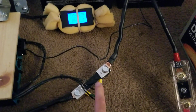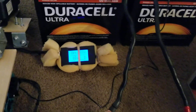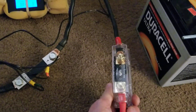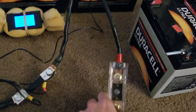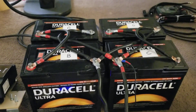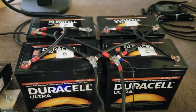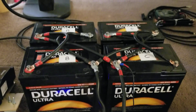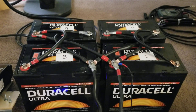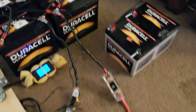My negative cable has a shunt resistor on it for the voltmeter. You can see my batteries are pretty much topped off — I'm just topping them off now. I have a 100 amp fuse protecting the battery bank on the positive line. Ideally, every one of these batteries would have a fuse between them, but that's only in the case of one of them failing prematurely and short circuiting — you'd want to protect the other batteries. I'm risking it because this is supposed to be balanced, so no battery should be failing prematurely. I just have the one fuse, but maybe I'll add fuses in the future for safety's sake.